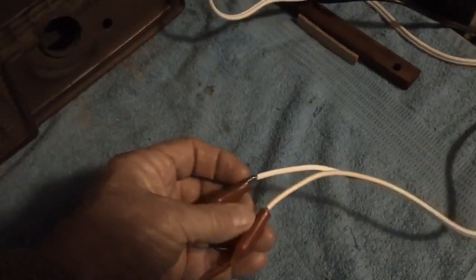It is the big moment, ladies and gentlemen, the big moment to find out whether or not the fluorescent light around that screen cover, whatever you want to call it, bezel, whatever, is going to work. And what I've done is the two wires down here that run back to the primary on the transformer, just two wires. I gator wired those over to an electrical cord that I have. I had soldered ends on it. Bare ends, and I'm going to go ahead and make sure they don't touch. And then I've got that plugged into my power strip up here, and all I'm going to do is hit the switch, and I hope it does not light at first, because I think I've got the switch off.